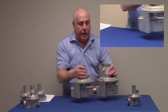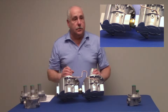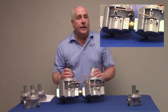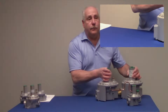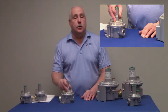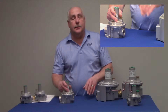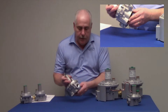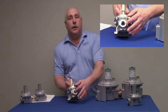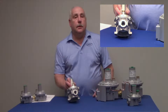On the high-capacity models, where you see the inlet, the outlet, and even the control port, they are already tapped and plugged. So all you have to do is open them up and away you go. If you are going to use a control port — meaning if you want to control way down where your appliance is but your regulator is here — the little tube that senses the control in the unit just takes some silicone; fill up that tube, and then you're going to be able to monitor from your control port down the way.